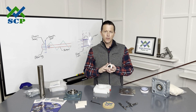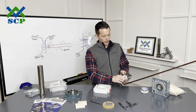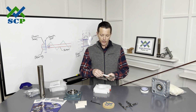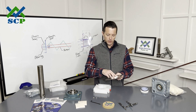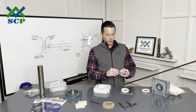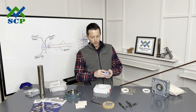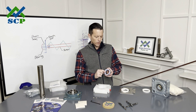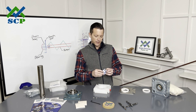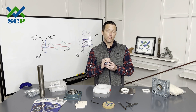These are the rotor cups I talked about earlier that form the seal. You can see kind of in here where it forms the seal right there — and that's really your effective shaft seal for your conveyor, between this rotor cup and that front face. The only other place material could possibly move would be in through the shaft in this boot, but that's not really possible because of the width of it. So here we have an adjustment band clamp — the point of this band clamp is to put compression onto the shaft.